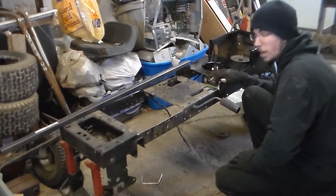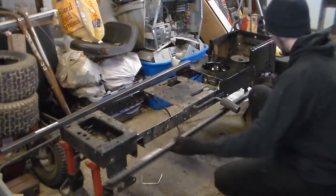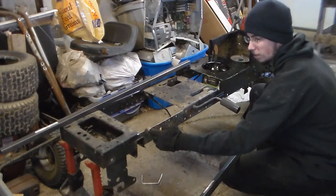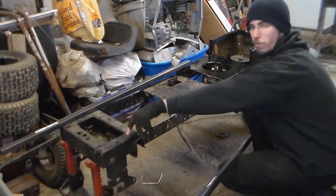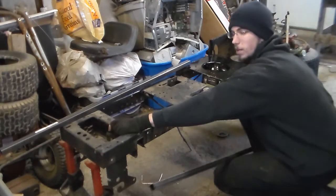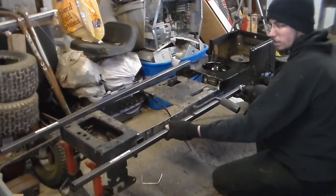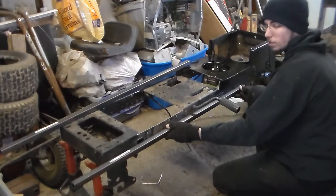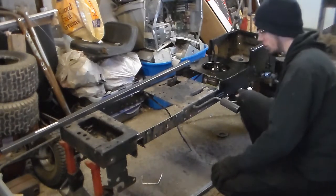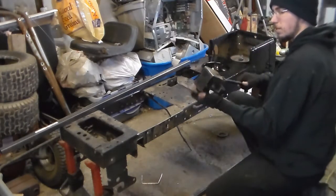Now we get into really chopping the thing. In my next video, I'll be taking this square stock and cutting off the entire front piece on both sides, and cutting across the front of the assembly. This assembly will get inverted and become the front end so the front axle is right up front. Eventually I'll make it into an A-frame assembly, but for now I need this piece just to test the concept. The square stock will get welded on the outside here so I have something to tack my front end onto, and on the underside I'll put a cross brace across the entire thing — that'll give me the chance to build a skid plate to cover the transmission.